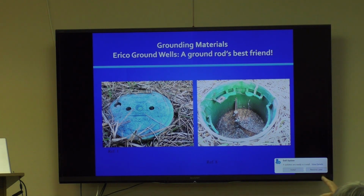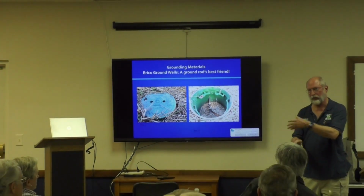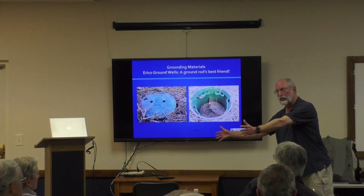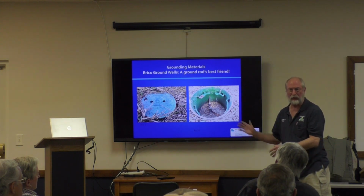And your copper strap is just uninsulated. It's just in contact with the ground the whole length. And that's beneficial. Contact with the ground, that's the effect I was talking about. It's way better than wire. Huge surface area, sharp edges, and electromagnetic transmission line loss due to the earth contact serving as a dielectric, a conductive dielectric for the strip.